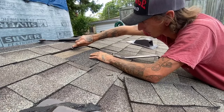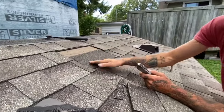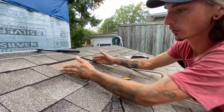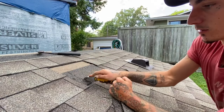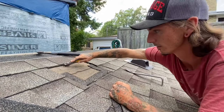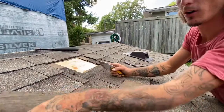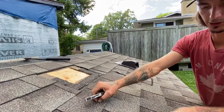Make sure you get all this stuff out of your way. As you can see, this shingle now has the backing still in your way, so you're going to cut that out. Usually your box vent will be about an 8x8 or 10x10 inch square, so you wouldn't have to cut all the way to where these lines are. You're going to have that much width on your actual vent hole, so you can cut it to where your actual vent hole lands. I'll cut out the tar paper so you can see where it would be, making sure to get it all out of your way so you're not restricting any airflow on your vent.